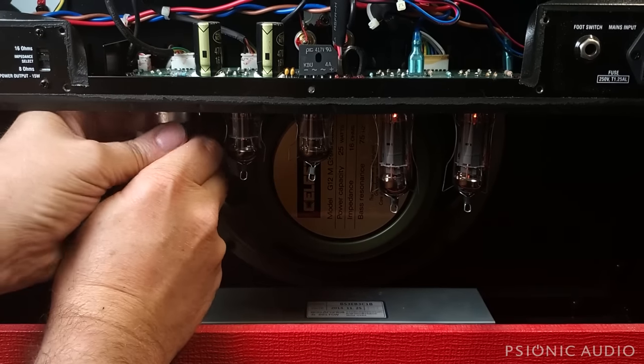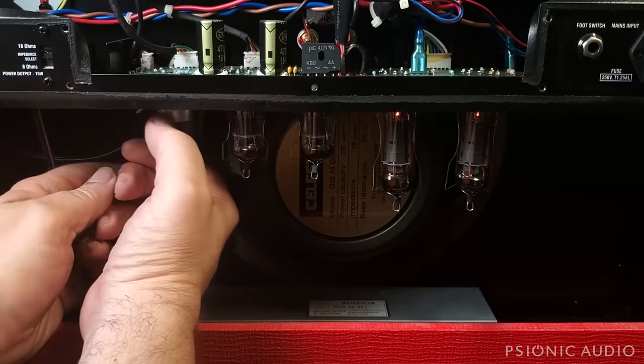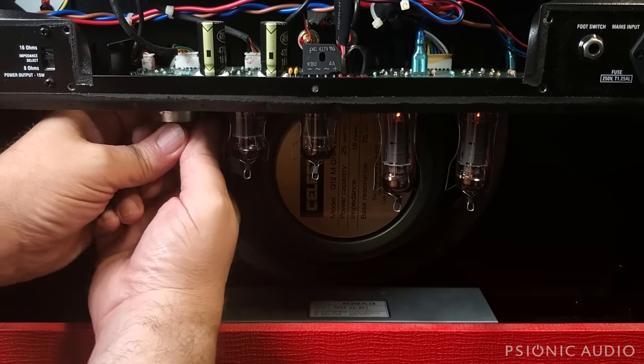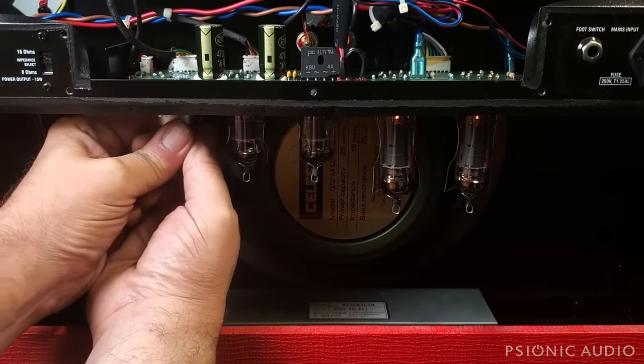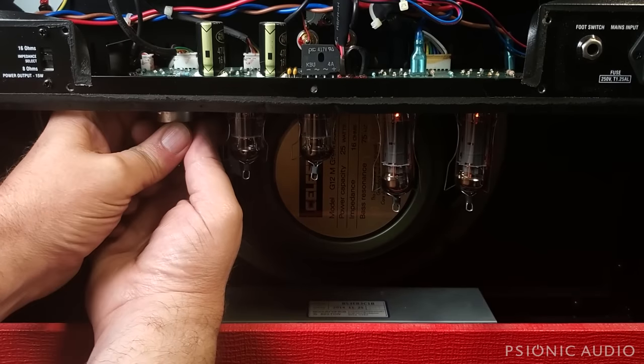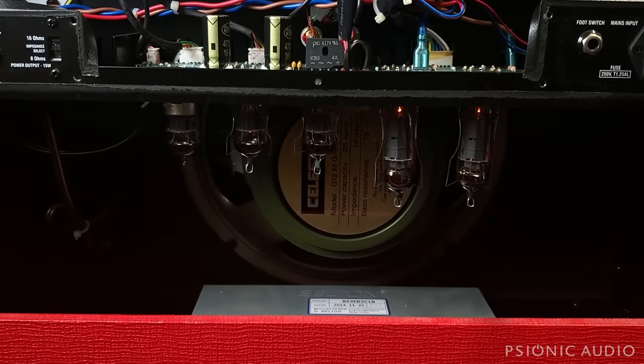They're ceramic. The issue is that the base that holds the tube shield has an opening of a fixed diameter. And some current production tubes, this may be a Russian one, are a real tight squeeze in that. You run into that on a lot of amps, including the old ones.